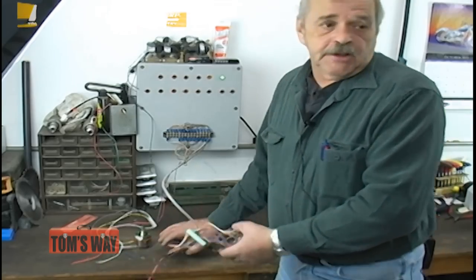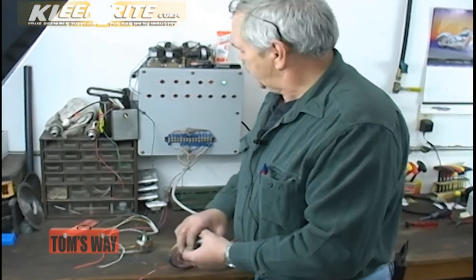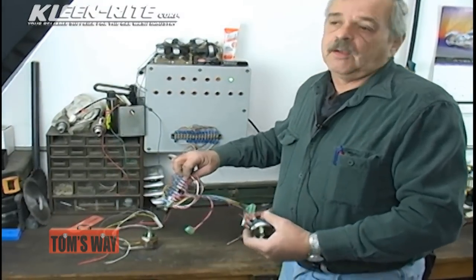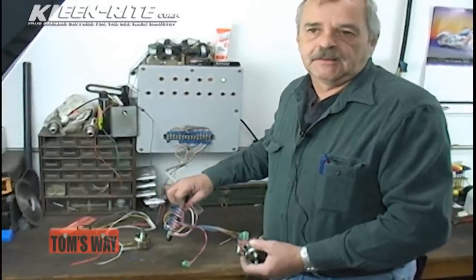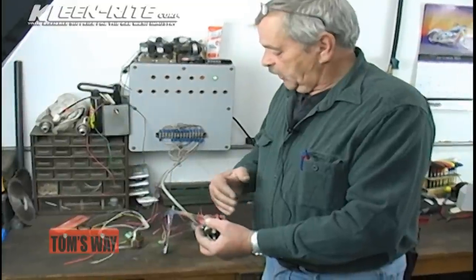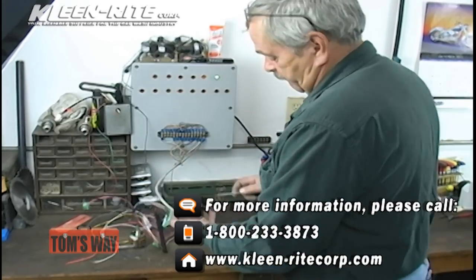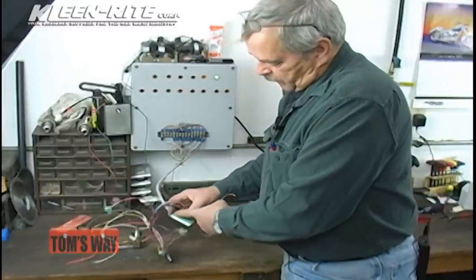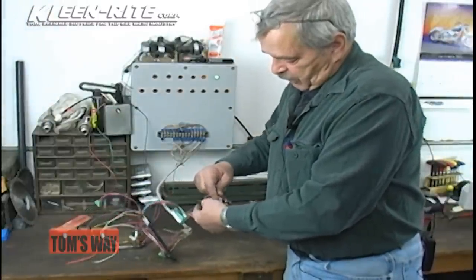With the QC switch or any switch that you're wiring, you want to make sure that you have the same color code from the rotary switch to the end of your coin box or your terminal strip. If you're running new wire, then you're going to run the same color code all the way back to your pump stand. So if you want to change a function on a QC switch to correspond with what you have back in there, it's just a matter of popping the wire off, going back to the plug, finding out what color is what function, reinserting that color in that position.